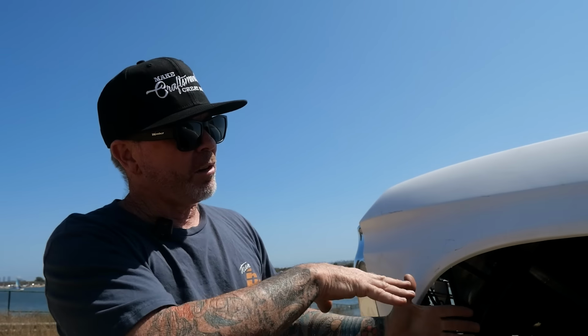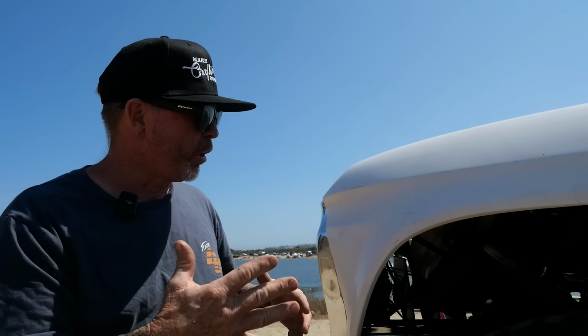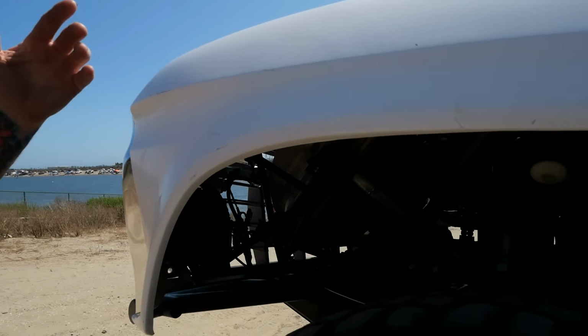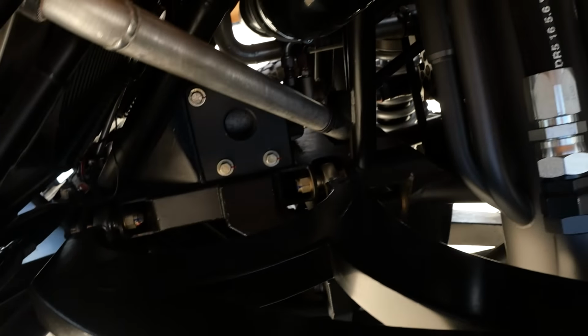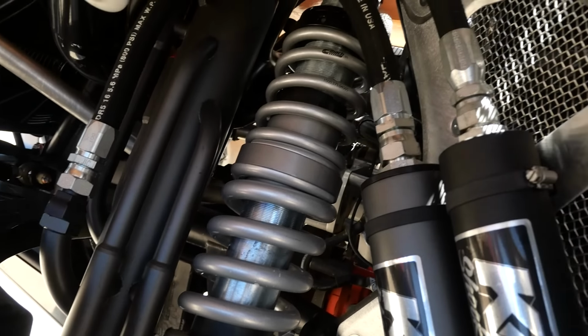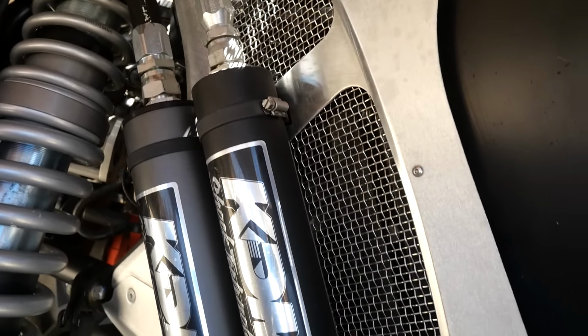So Morgan even built these arms out of that CAD file and welded them up and put them all together. And he also put in extra bracing and extra things where the bump stop would hit and things like that to make it even better. And this Jubera fab was only supposed to allow a 2.5 coilover, and you re-engineered that too. So it is a true 3.0, 4.0 bypass configuration, which you probably couldn't do unless you re-engineered that